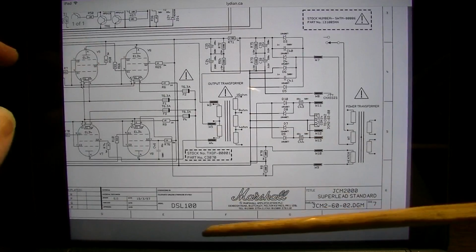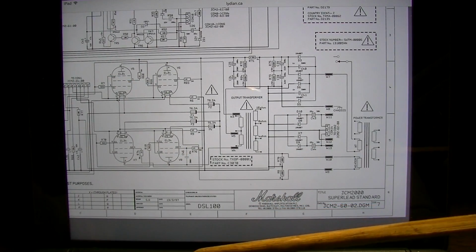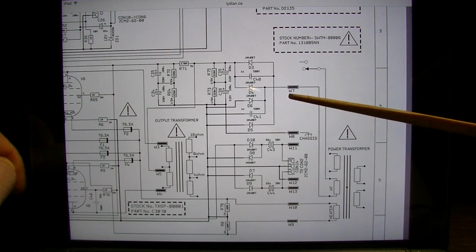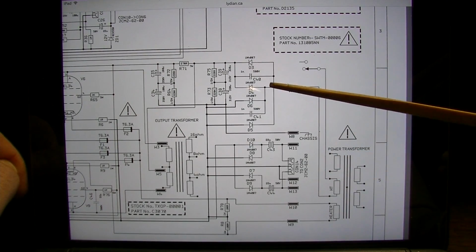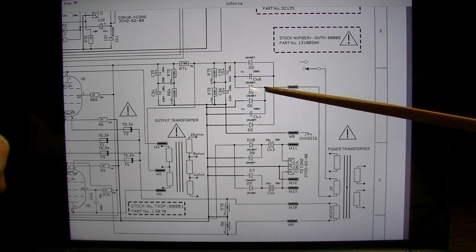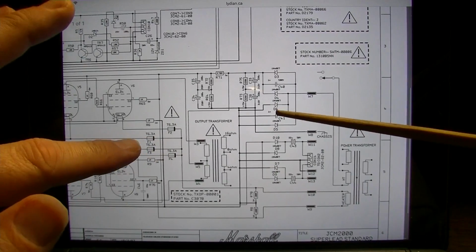I'm just kind of curious why it would seem fine for a minute and then kind of suddenly go. Probably what we should do is just start checking anything that's connected to the high tension and basically start at the fuse and work our way through. So, you know, start eliminating things. We'll eliminate D4 and D6 and C41 first. I mean, these just go to ground.